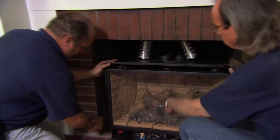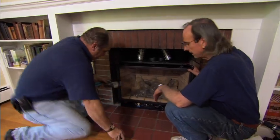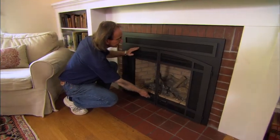All right, good. I've made the gas connections, but I'm going to turn on the gas downstairs and test those connections. Okay, and I'll make the exhaust and the intake connections here. We're using the high temperature silicone, which can withstand temperatures up to 500 degrees to make the connection down here. There we go. I just installed the arch doors and it's all set to go.